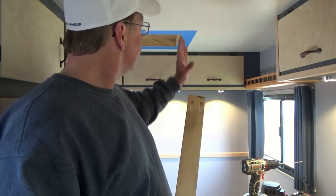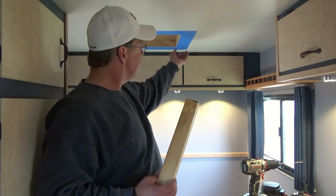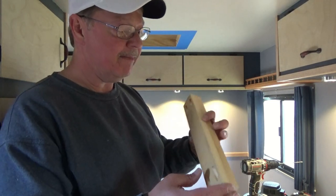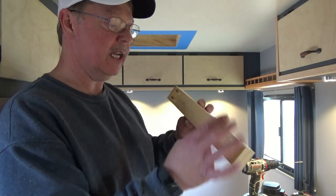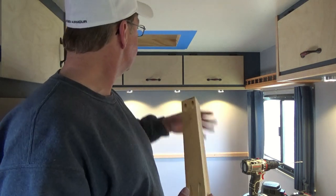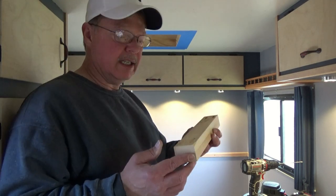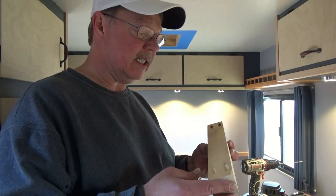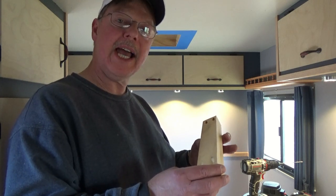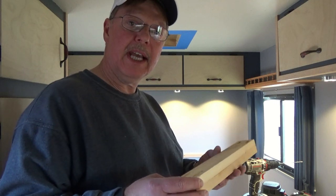For the sides here, to make sure I've got some meat to bite into when I go to fasten everything down, I have my sticks made — they're inch-and-a-half by two inch — and I have pocket holes drilled on the ends, which I'm installing now. I'll get this installed and then give you a shot once it's nice and cleaned up. I'll take a router and make sure all the edges are nice and pretty, and then I think we're ready to go on the outside.